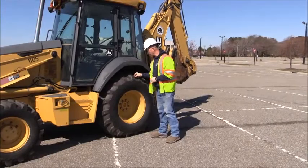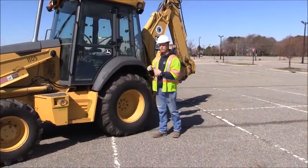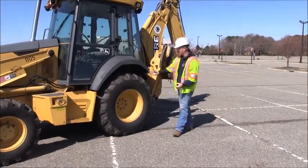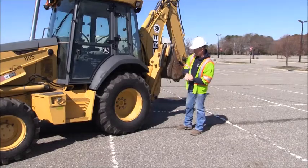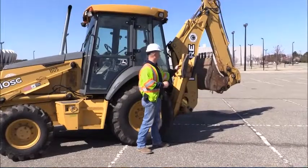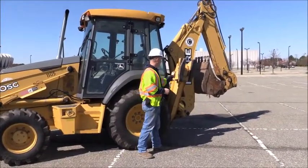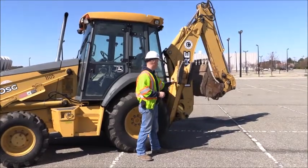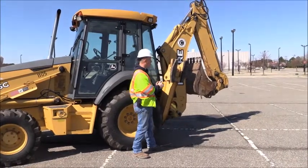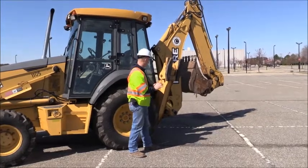For this walkthrough, we won't go through each individual spot, but remember you would check both sides of the vehicle the same, and check all tires similarly — tread, the rim, the lug nuts, everything on all tires going around. Now I'm going to check my driver's side outrigger. I want to make sure my pins are in place and the cotter pins are in place. I'm looking for apparent damage, maybe shifted or bent up. I'm also going to look at my pads to make sure they're in place — that's where you get your traction and stability.